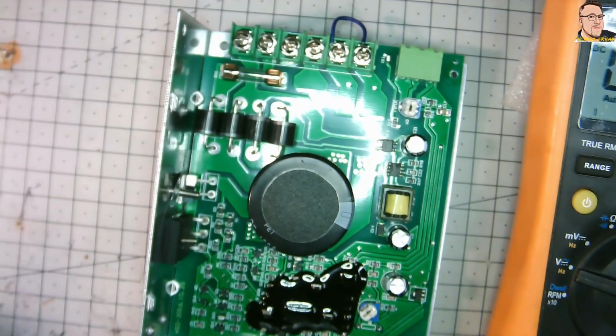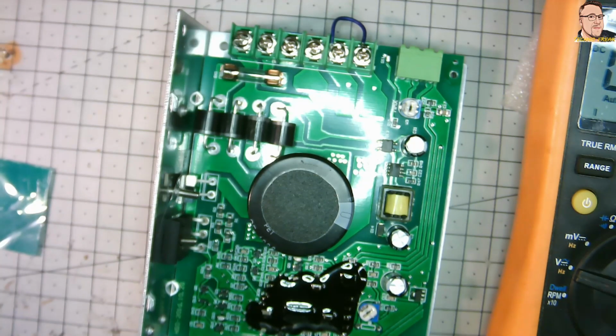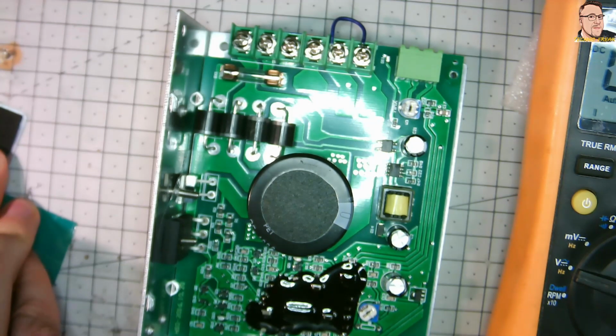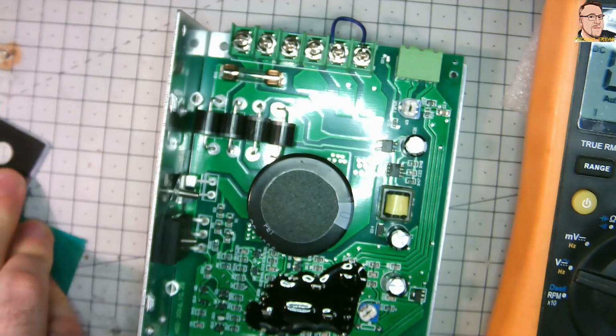How do you know if they're under load? If you leave your machine running, making some cutting or engraving or whatever for, I don't know, an hour, these power components will reach the temperature when this plastic starts melting and shrinks, and then you got a contact. In the best case scenario, you make some short and your fuse is blown.